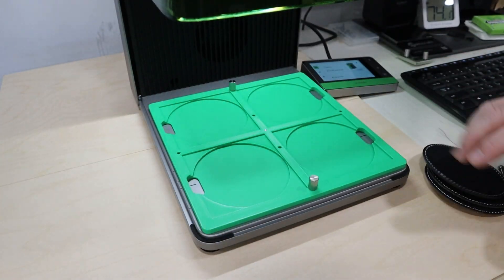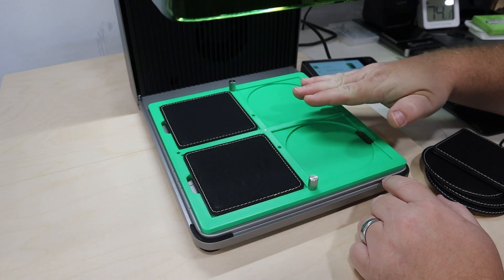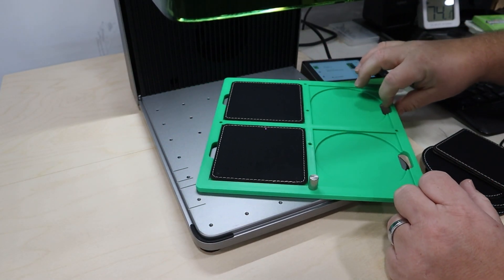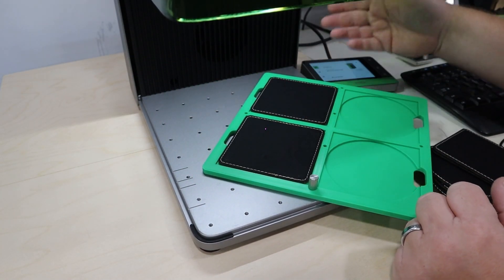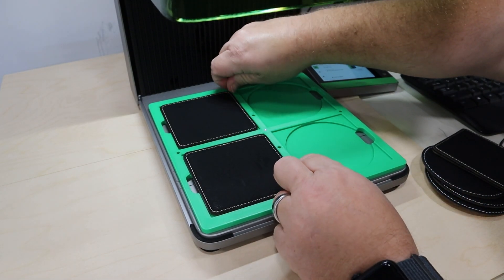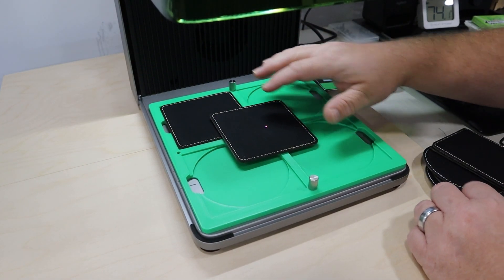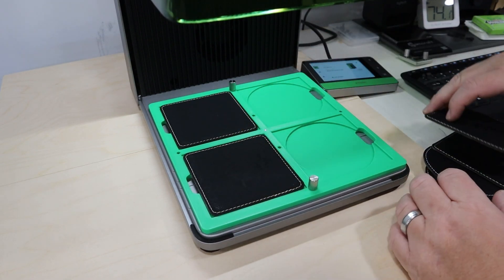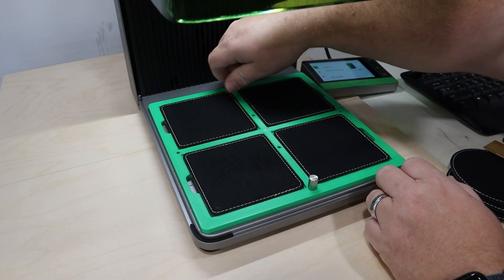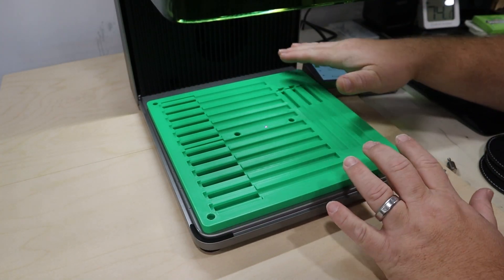The same concept applies to square coasters since this is a two-in-one jig. However, with squares we're at a different height. I'll loosen the thumb screws, pivot it enough to where it's on the surface, raise or lower it to refocus, then pivot it back over, put the thumb screw in referencing the holes in the bed, and we're good to go. A perfect world scenario would be if all objects were in the middle, but that's just not the way it panned out when dealing with irregular and various thickness objects. So this is Sam's recommendation: pivot it over, adjust it, put it back.